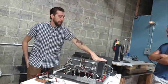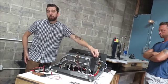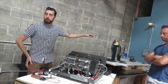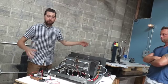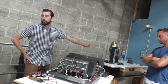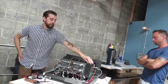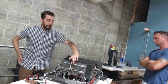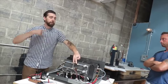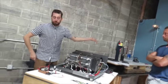So from here, basically this is kind of the breakout box. This has a small computer in here that takes information from the Nexus tablet and converts digital information from an Android operating system into analog outputs. So basically all this is doing is taking instruction via the USB cord from there to here and saying, okay, I'm seeing this many counts here. It's just looking for analog. I'm seeing power, I'm not seeing power when the thing is flipping around, and it just counts. Sends that there, that converts it to ounces.